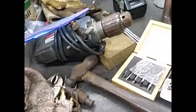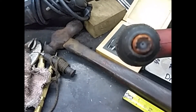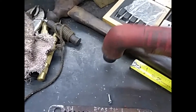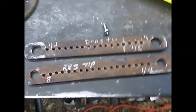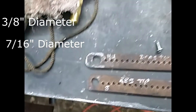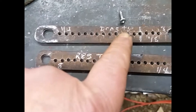This is a drag tip — for you guys not familiar with them, you notice it's got little notches in it. You just set that down on the surface and drag it. It's a little bit different than the cone, the pointy cone. They're a little bit different diameter — you can see this hole's a little bit larger than this one. We got ready to cut the holes and I had my regular tip on there; you can see the regular tip, that's the drag tip.